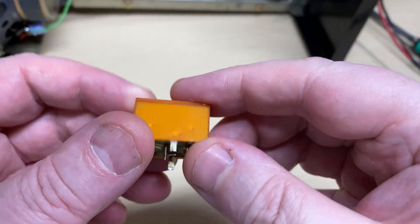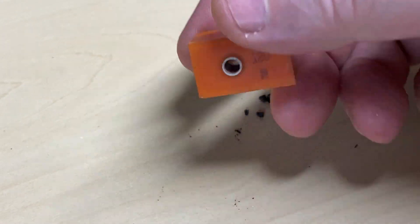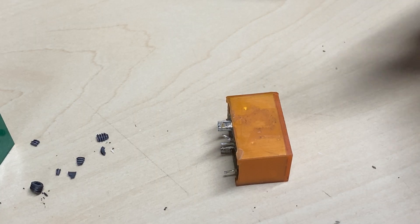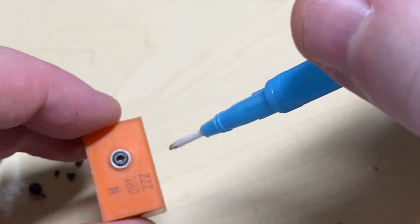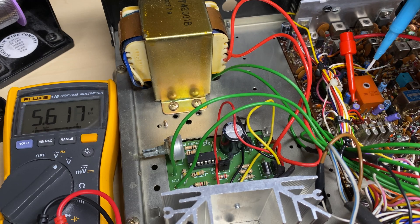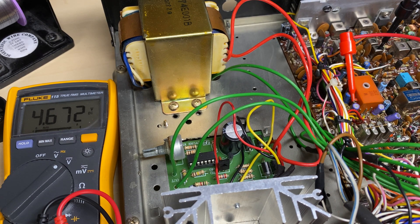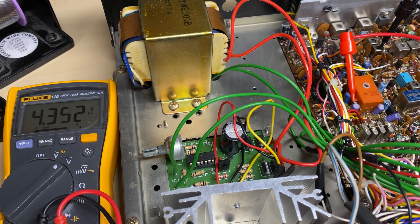So I took the VCO out. I was hoping there'd be a hole in the bottom so I could unscrew it from the bottom, but there's not, so we'll have to make our own hole. I've carefully drilled a hole through the bottom — if it wrecks the VCO I'll just replace it, but we might as well try to keep the original since it was working. I've got a slug from another VCO — it's a bit sloppy so we'll need to put a little bit of wax on it once we tune it, but we've got it going. VCO's back in the radio. It's a little bit twitchy due to that core being a bit loose, but once we've set it we'll put some beeswax in to hold it in place — not candle wax like some people like to do.